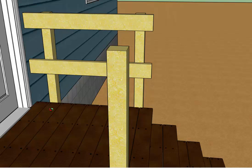For a 4x4 porch, you can cut both of these railings at right at 48 inches — they should give you a little extra length which you'll be trimming. You can install these rails now, or have someone hold them in place while you make a few marks, then take them down and make some cuts. Sometimes it's easier to put one screw in each and make the marks, then take the screws out, cut, and put it back in place.